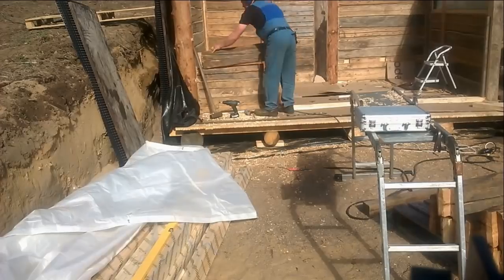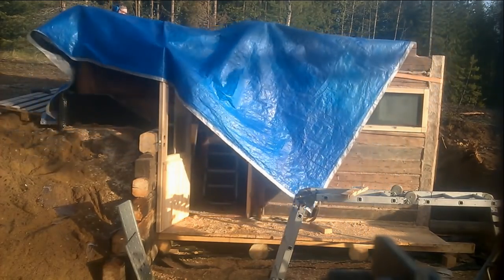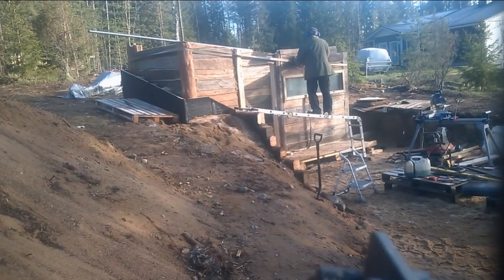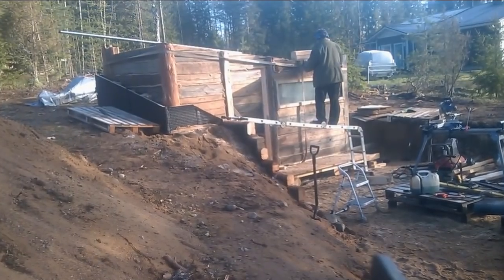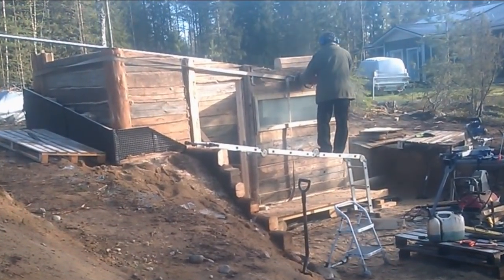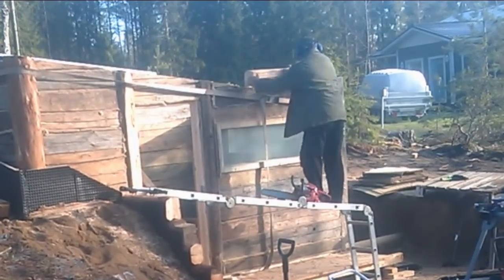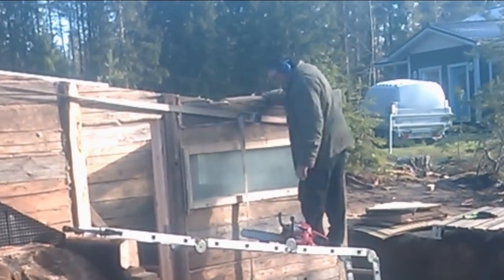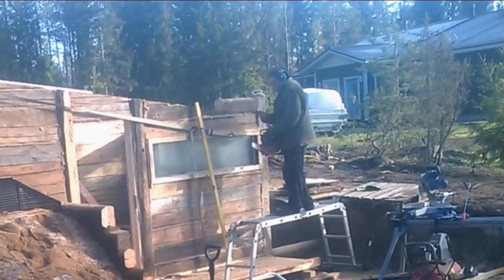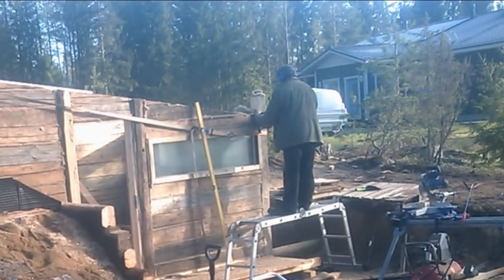So the first thing is to decide and cut the roof line. I discussed the line with the customer, set a chalk line and cut it by hand, but it would be worth using a guide system if you've got the opportunity to do so, because it's important to get this line quite straight. So with the first wall cut, I just transferred the line across to the other three walls and got those cut to the same line.